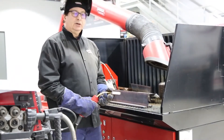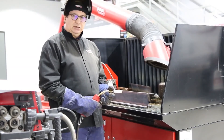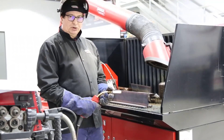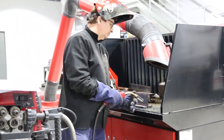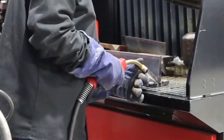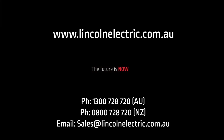Okay, we're on program 22. We're going to be using 1.2 ER70S6 with a mixed gas, a 90-10 mix. I'm going to put down a weld in a 2F position and you'll notice from the sound that we're in pulse. Watch your eyes — welding.